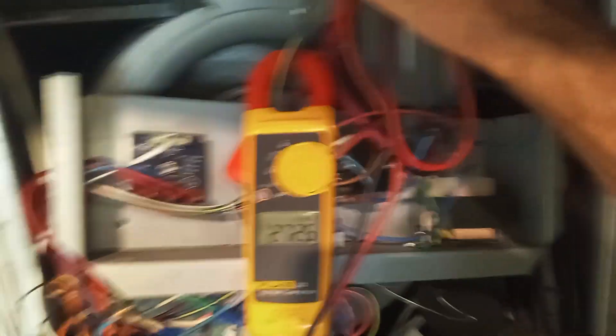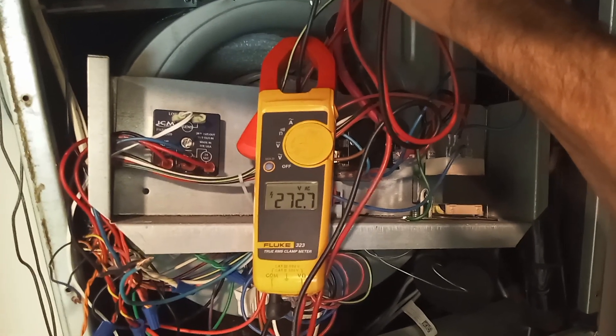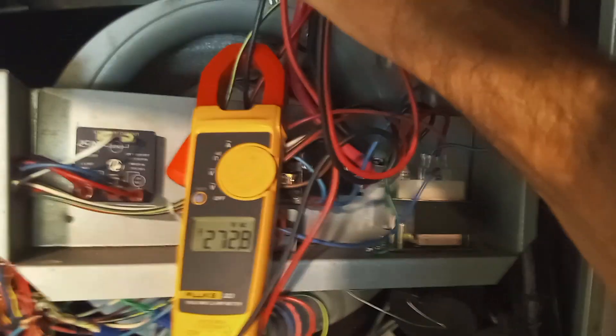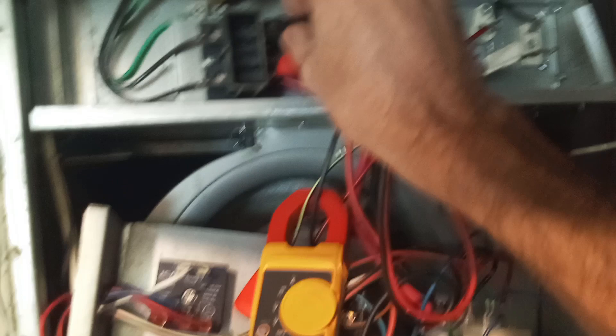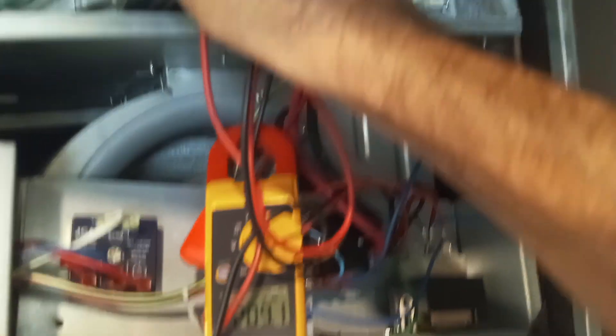Attention — life depends on this. Do you see that? There's 272 volts there. 272 volts — and this is only a 230 volt unit. So what's my incoming power? Wow. With the disconnect out, this unit is still hot. Turn off the breaker to the indoor unit.